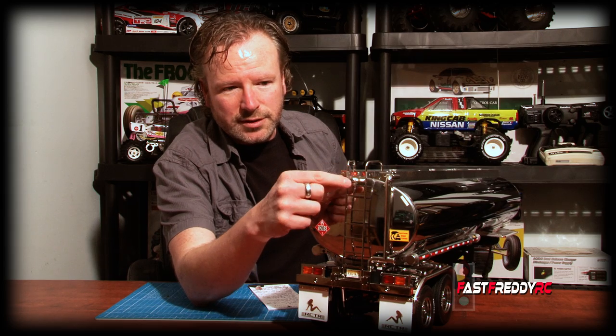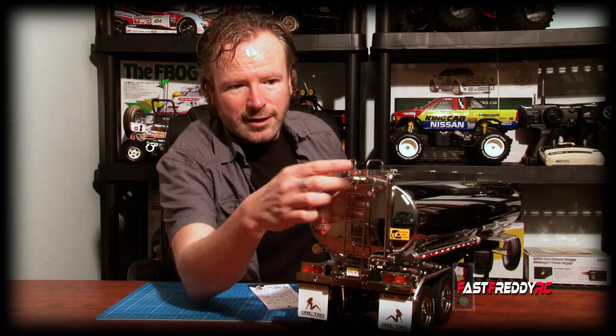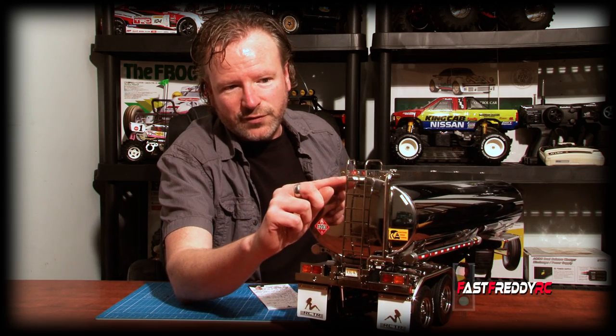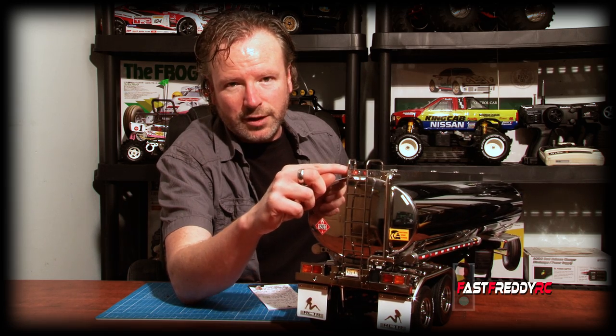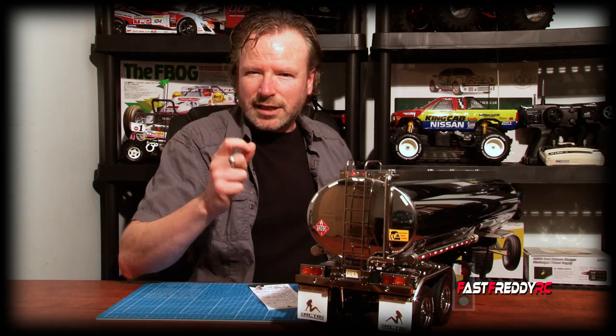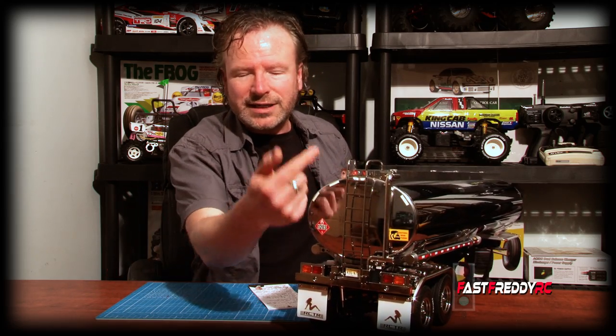I would suggest when you get to that step that you put the plastic ladder into the metal piece first, then put the piece into the holes. Because what I was finding was the plastic wasn't completely going into the metal that well, because the metal is a little tight, which is fine, that's what it's meant for, but it means you don't have any leverage.